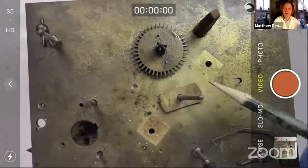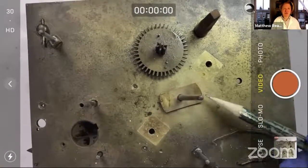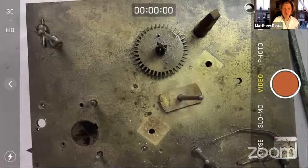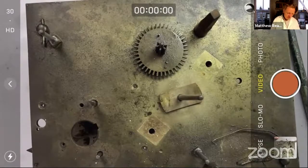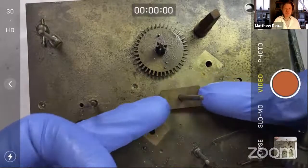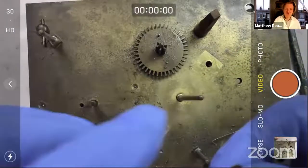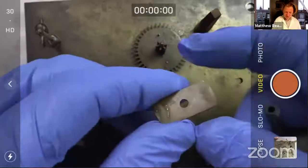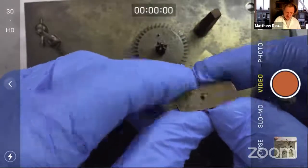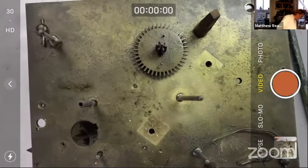So two things there. One is that you lubricate the tips of the spring where it touches on the back of the cannon wheel. Otherwise, when you turn the hands, it makes this really grim brass on brass screeching sound. And two, the spring has got to be really compliant. Otherwise, you've got to really force the hand round because the turning moment is a much larger radius. Anyway, I don't think even I can talk about a friction spring much more, or a cannon wheel.